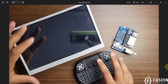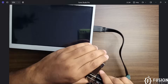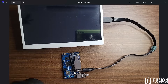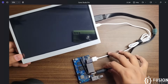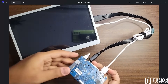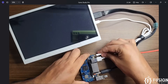Now we are going to connect everything and see the live booting from the USB. I'm connecting the board to the screen using an HDMI cable, and then connecting the screen to the Orange Pi RV2 for touch and keyboard inputs using a USB to micro-USB cable. Then I'll connect the power supply and that's it.